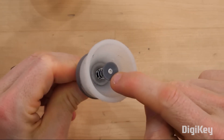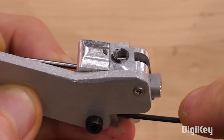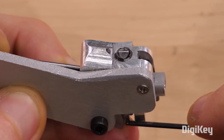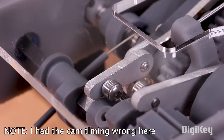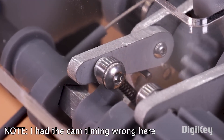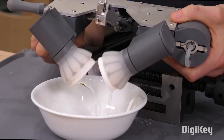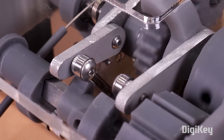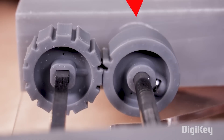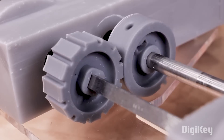There's a plunger to eject the shell once the egg is broken. With all the disparate components designed and working, next he needs to create the mechanism that will make them all do their job at the correct time, since there's no way the egg splitter is going to work if the shell isn't already scored and broken. Much of this is done using cams, but there's also a few elaborate gears that work a little bit like a Geneva mechanism to turn regular rotation into a more stepped rotation.